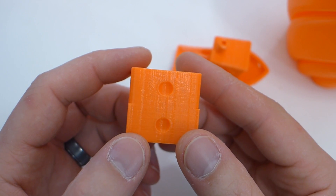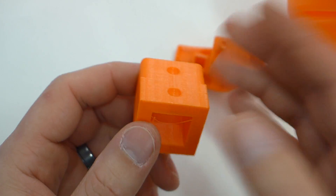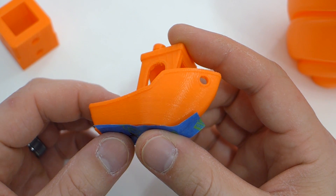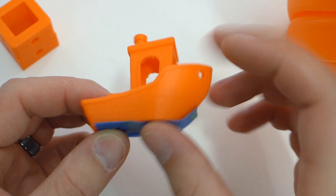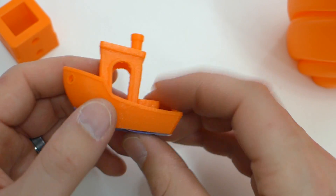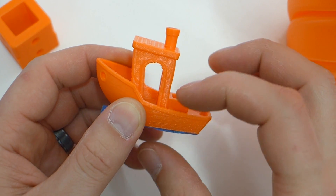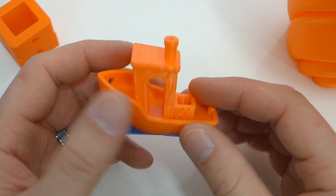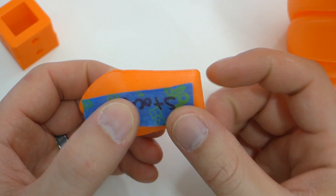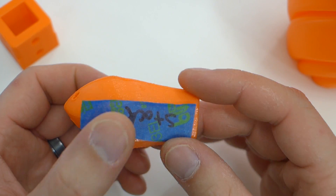That's a problem because we don't want that. You can see that looks like just absolute crap. It does top layers fine and bottom layers generally come out okay. It's really just when it does these walls that you really see the difference. Here is a benchy using stock. You can see this salmon skin — see that rippling going around? If it was ghosting, it would only be like four or five right along there. But it's not ghosting; it is the rippling from the salmon skin. It's on both sides, it's up in here, it's down on here — those swoops going through there. It is all over this thing. With those artifacts on the perimeters, it's not that great. You can feel the roughness of it. And this is all stock.